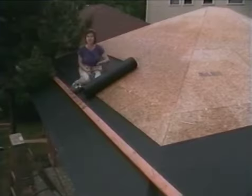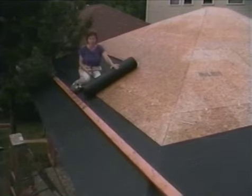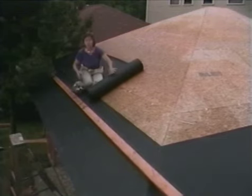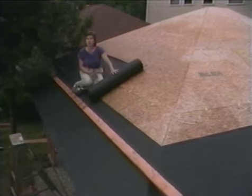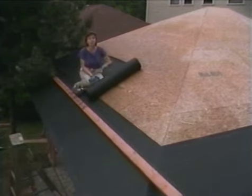What I'm doing is I'm stapling roofing felt to the sheathing of our roof. The roofing felt acts as a weatherproof skin underneath the shingles we'll be putting on later. I'm rolling it out as smoothly as I can where I started at the bottom. With each consecutive course, I'm sure to overlap the edges until the entire roof is covered.